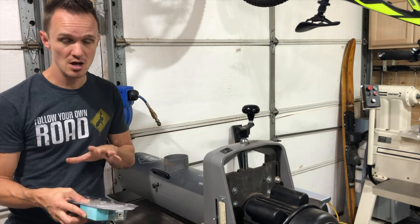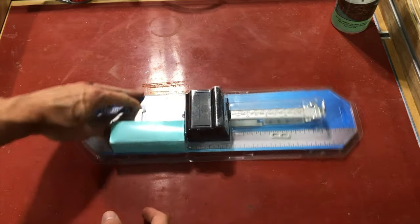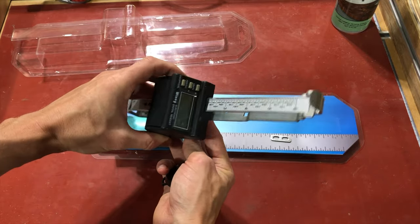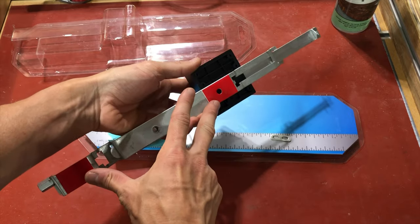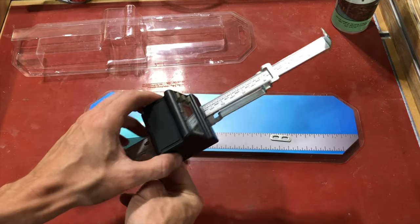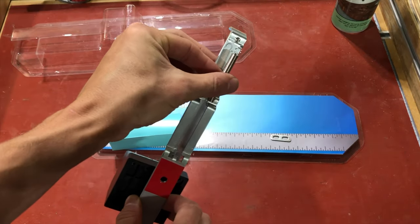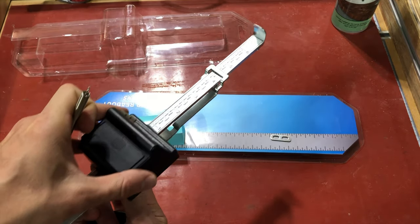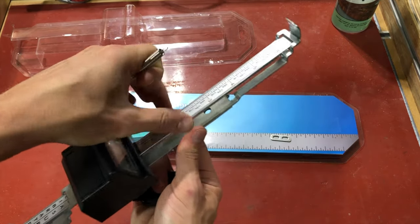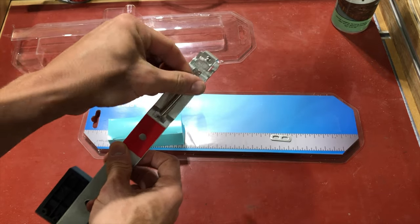I think I've come up with a way to install this on this machine without having to buy that expensive bracket and save you guys a little bit of money. If you can't follow along, leave a comment down below and I'll try to go through this as precisely as I can. So let's start off by going through what comes in the box. You have the unit which normally mounts on your planer, some double-sided tape, and a screw hole on the back. The first thing we are going to do is remove that little spring — it attaches right here and returns the mechanism to where it needs to be.